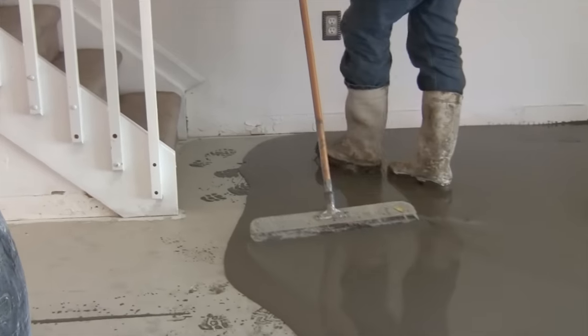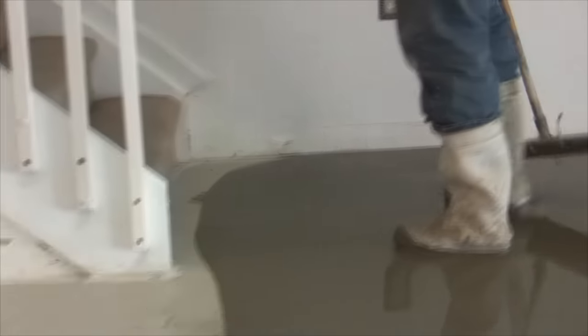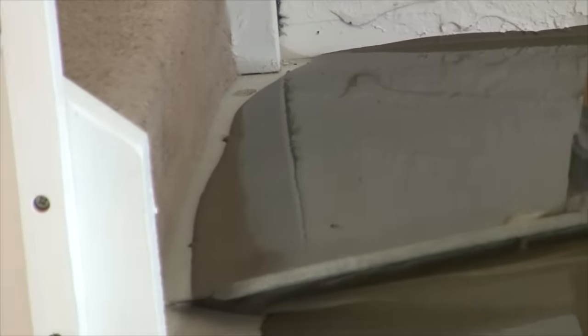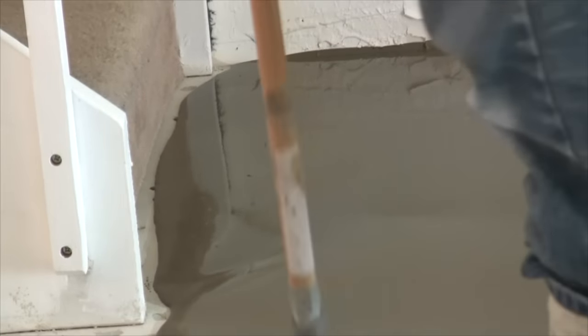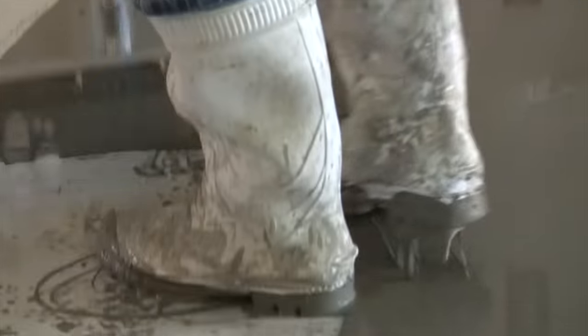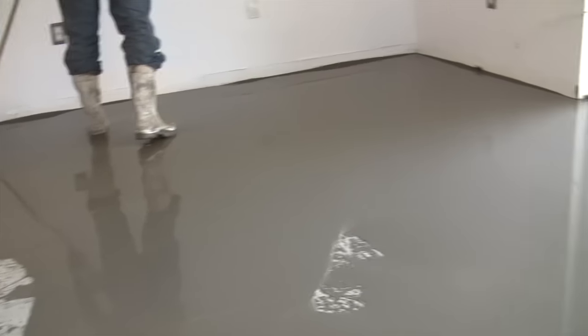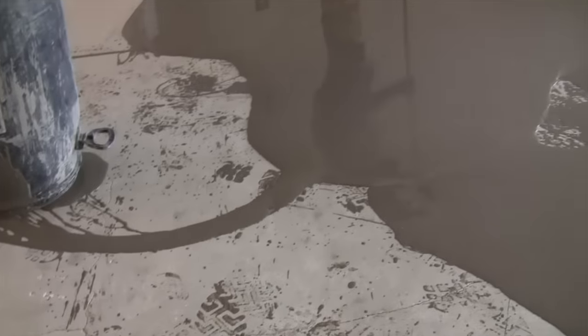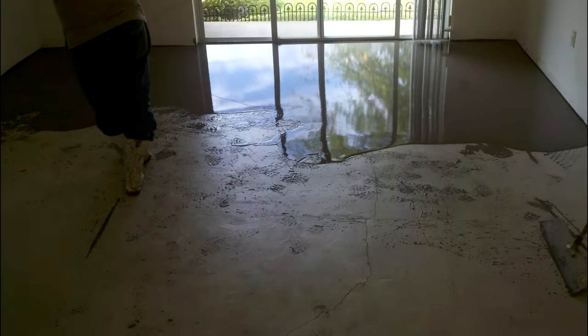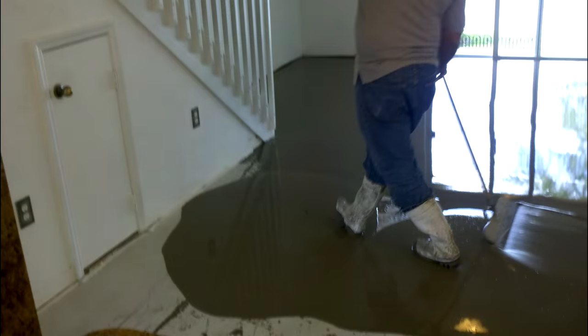This all has to be a very well-choreographed action — it's a team effort, and it keeps the process moving. You really can't do this by yourself. He's taking it right up to the bottom of the stairs so that when we install bamboo wood flooring or laminate flooring, it will be nice and flat. Remember, the Tile Council of North America specifies that if you're going to tile a floor, you lay down a six-foot spirit level and you cannot have more than an eighth of an inch difference across that six-foot span. Pouring self-leveling compound gives you that perfect flat top surface.